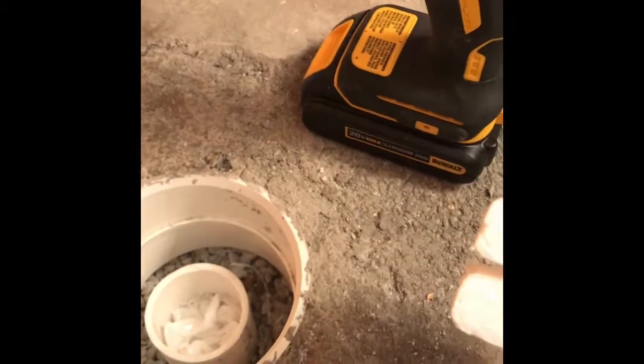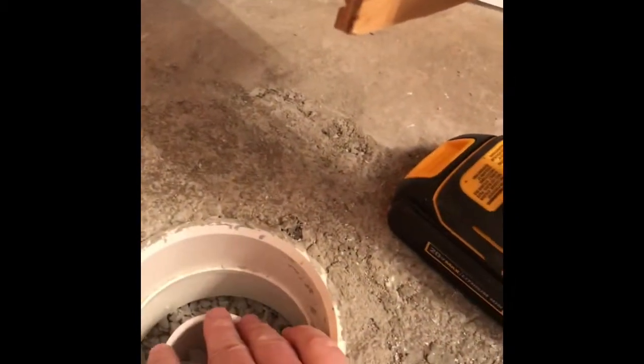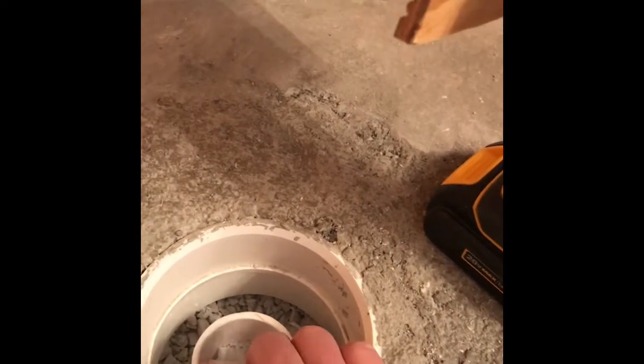This is the same spacing as the eventual tray I'm going to use. With newer iPhones in your Measure app, you can switch to a level mode. I'm setting the iPhone upright down inside the pipe and setting it on the edge to see which side is a little high. I've found that things are all pretty close to level except for one area that's a little high. You want to make the high spots level with everything else, not make the low spots lower. So I'm going to use my deburring tool focused on that high area.